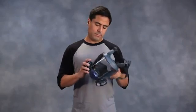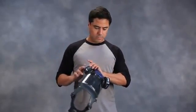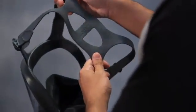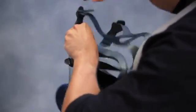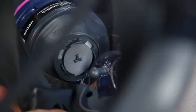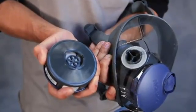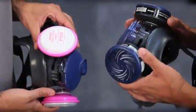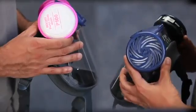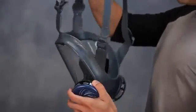It's important that you inspect your respirator before and after each use. Do not wear and return to your supervisor if: head harness is torn, cut, or damaged in any way; buckles or flange tabs are missing, damaged, or broken; face piece is cracked, torn, distorted, dirty, or has holes; inhalation or exhalation diaphragms and or gaskets are missing, torn, damaged, or not properly seated; cartridges and or particulate filters are at the end of their service life, cracked, damaged, or not properly seated; or any other plastic or rubber part is cracked, distorted, or damaged.